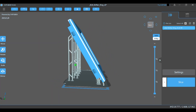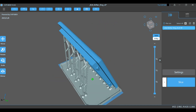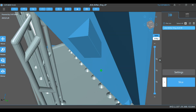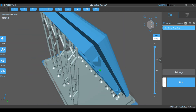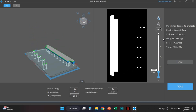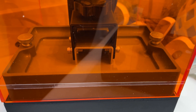Here I have my part set up in the slicing software for the 3D printer. I added four triangular pieces to the part that are sloped on top and bottom, so it's easy to snap into place but also won't break the feature when I pull it out. Here's what the machine will see one slice at a time. I have an SLA printer that prints really smooth parts, which will be nice for the finish.